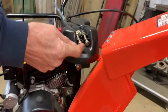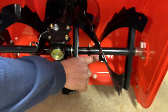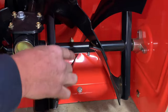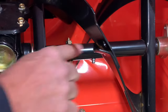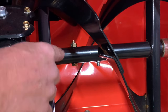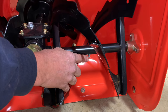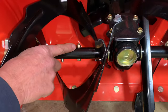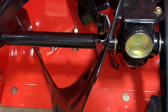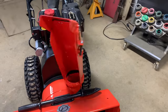These right here are the shear pins for the augers. Down on the augers, you have a shear pin here, and right here is actually a grease fitting. It's good to grease the shaft in case you ever need to take these apart or a shear pin shears. These shafts are supposed to be a little loose on the inside shaft, and they can freeze up through moisture and water — they're in snow all the time. They can seize from the auger to the shaft and you won't be able to move the shear pins. If you have a grease zerk fitting on the end of your shaft, pump it at least two to three times a year. There's another shear pin on this side with a zerk fitting too — so you have two zerk fittings for grease and two shear pins.